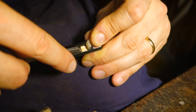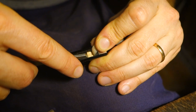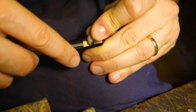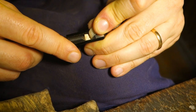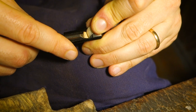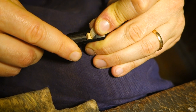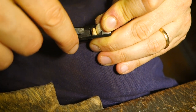The last thing to do is to remove the plug inside the frog. Same as you did to remove the plug inside the head, you will use your chisel. It's not a very difficult thing to do. What you have to worry about is in case your chisel slips, that you do not damage the frog or your finger, and for this you need to use a very controlled and safe movement to remove that plug.